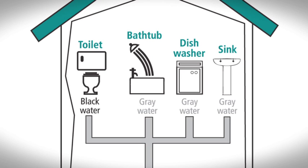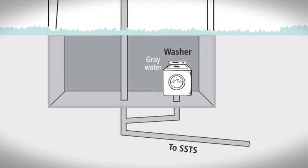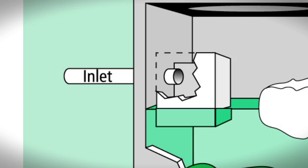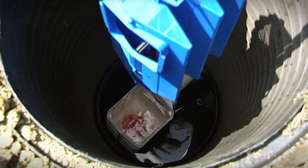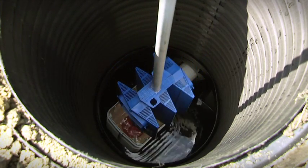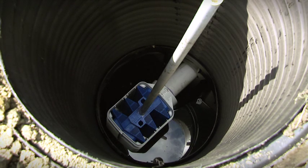All water used in bathing, toilets, laundry, and dishwashing must be treated by a septic system. The septic tank's first purpose is to collect all the wastewater used in the home and hold it long enough to allow the solids to settle and good tank bacteria to begin to break down organic material. The septic tank's other job is to store these settled solids, which must be periodically removed. If the tank is not cleaned, too many solids are allowed to leave the tank and will plug the soil treatment area. An effluent screen or filter can be placed on the end of the septic tank to further protect your soil treatment area by catching remaining solids that would otherwise make their way there.